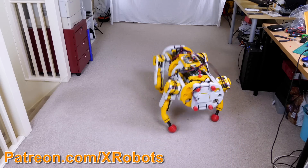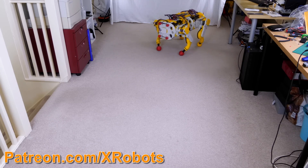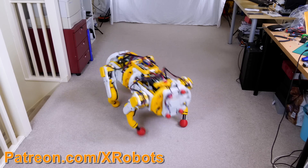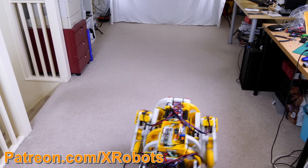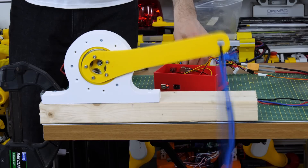The motor can be back driven, giving natural spring in the leg, held in place with a really high power brushless motor. So far in this robot dog — Open Dog version 2 — I'm using only 5 to 1 reduction belt ratios. What we really need is to get nearer to 10 to 1, make sure it's back drivable, and make something light, cheap, and easy to manufacture — hopefully with 3D printing to make it really accessible.